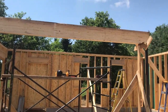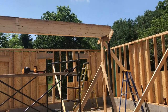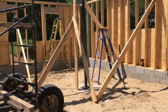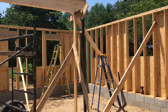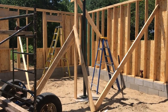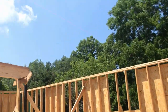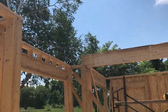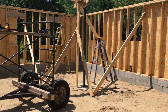We finally got the first beam up — that's a triple 2x16, one of the two main beams that's going to hold up the second floor. Without the tractor it was a little difficult to get up there, but Jillian was able to give me a hand, so we got it done. There you can see the steel post that I was welding earlier in the video — that's one of the two steel posts. There's the pad for the second post. There's a string line up there — that's where the second beam is going to go. Hottest day of the year, so we were doing what we could, but it was a little bit slower — we got it done.